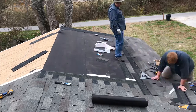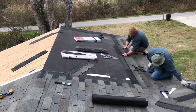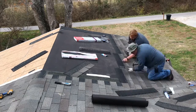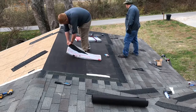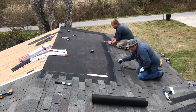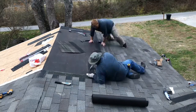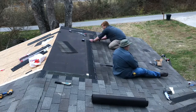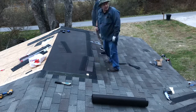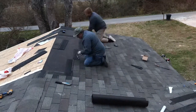You can see we got all the shingles torn off to tie into the existing roof. Then we put her drip edge on, then her tar paper, then her starter strip — which is just a three-tab shingle upside down around the edges. You let it hang over half to three-quarter inches over the edge, and that gives you a starting place before you begin your first row of shingles. Then we just run them up and tie into the existing house's roof. It gets dark again for another day.